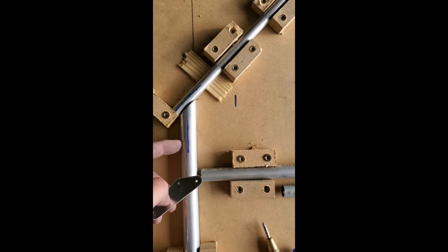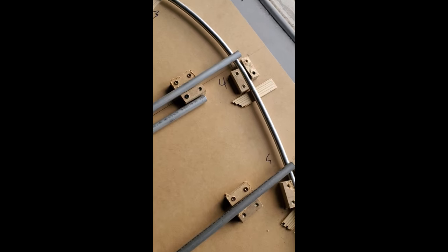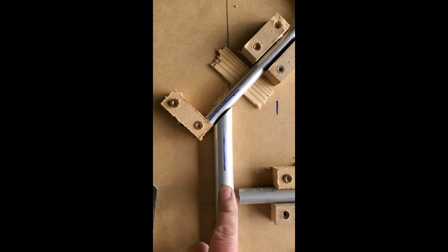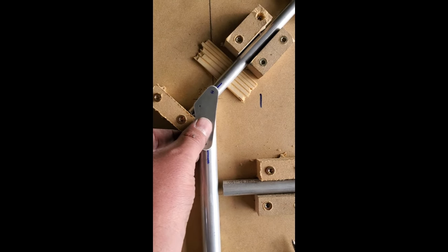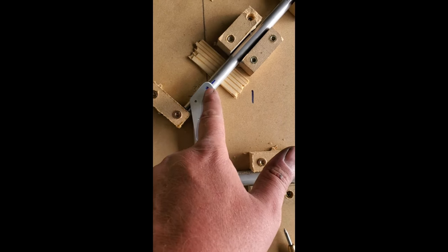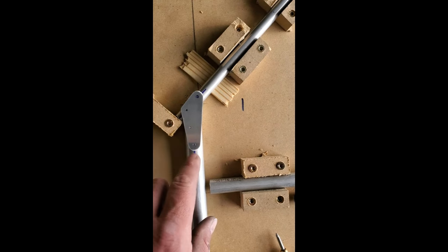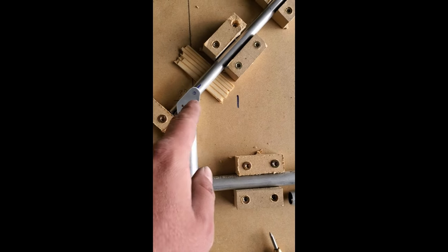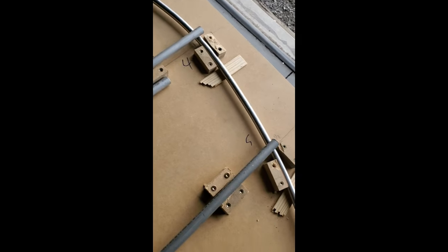All right, so we have the rudder spar back in the fixture here. This is the trailing edge curvature. Now we're gonna start installing these gussets. You can see that I've drawn top dead center on the spar and on the trailing edge. This is the gusset that goes there. We wanna see those lines through the rivet holes. So I'm gonna mark that one first on the tube, drill it, and then mark this one on the tube and drill that. We'll cleco it with silver clecos, and then we'll use the gusset as a template to drill the remaining holes. And we'll do that for all the gussets all the way around this.